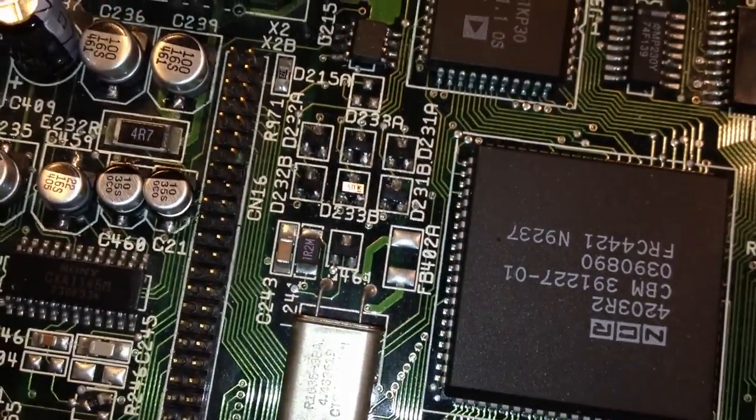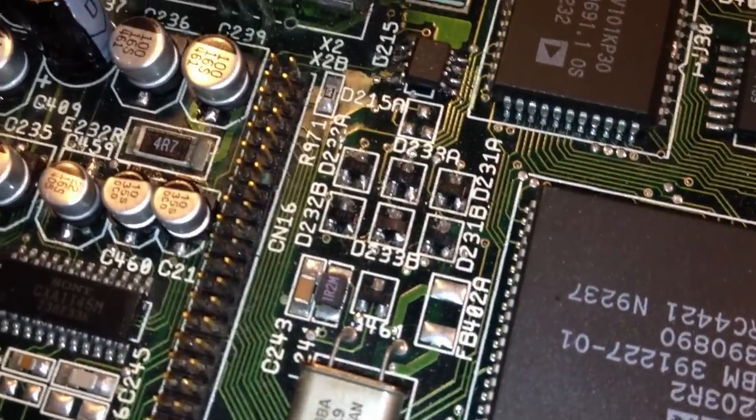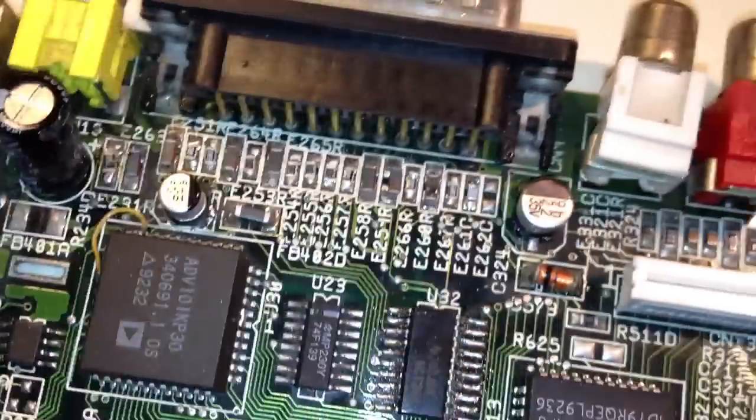And also, I think it's easy to see, if we take a look at the motherboard here, that the soldering job is not really that professional. I don't know how well you can see that, but a lot of components are just soldered really sloppy. So someone has been playing around a lot here. Incredible. Not strange we got these maximum intensity color problems. So I think it's time to swap those resistors back.